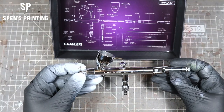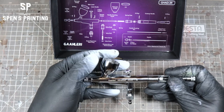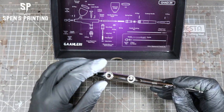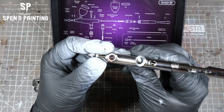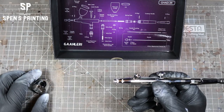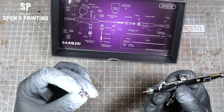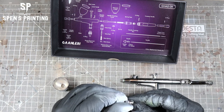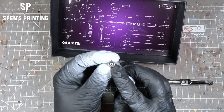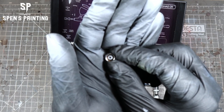This airbrush is fairly typical — no real surprise parts. When I clean, I generally use cotton buds with airbrush cleaner, rubbing them over the surface. When taking the needle out, always push it from the back of the airbrush through the front — this prevents paint particles stuck to the airbrush from being pulled back into the internal workings of the rear. We take everything apart, take the nozzle out, give it a good clean, and use some little pipe cleaners to get any specks of paint out.